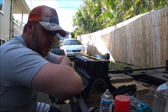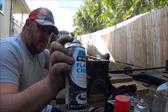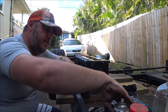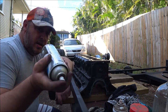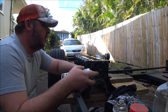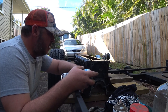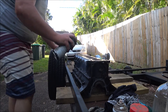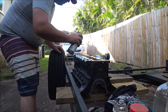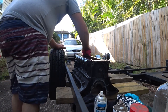The reason I'm doing this outside is this stuff makes a hell of a mess. It's a three-part process: it's a cleaning agent, then it's the dye — the penetrant — and then it's the developer. So the first thing I'm going to do is clean it with this. Now that we've got it relatively clean, contaminants will show up in the test. I've never done this on an engine block before — we'll see how it goes. Let's give it a minute to work on the surface and wipe it off.